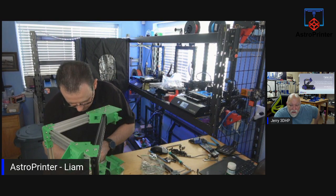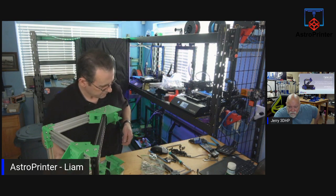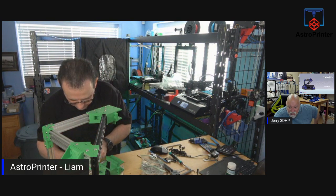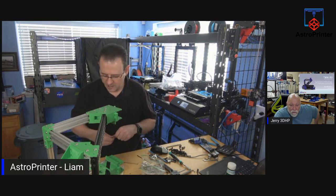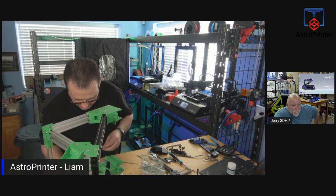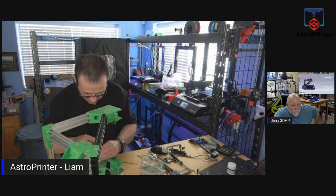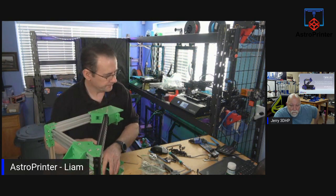Zolan says for the Ender Extender kit, I made a custom loom that the original wires plug into this way. If I want to go back to normal size, I don't have to hunt down the original wires. They are still in use. Well, I'll be just making the wires longer. So if I ever want to go back, I can just use them as is. You know, just tuck the wires away afterwards. That would be my goal to do it.